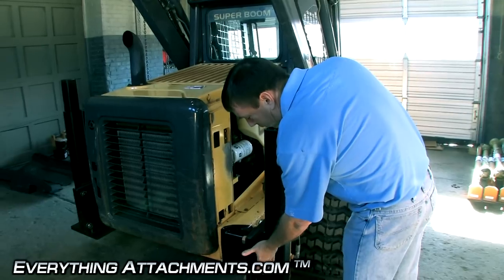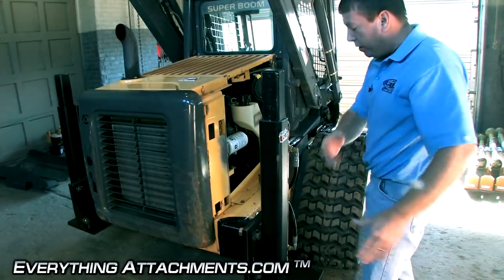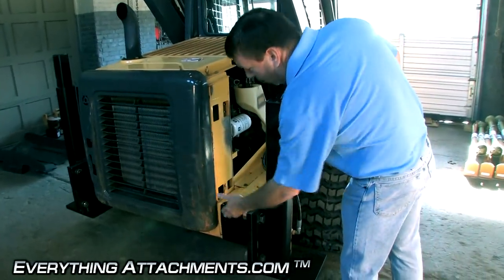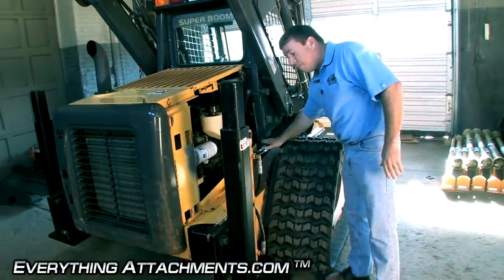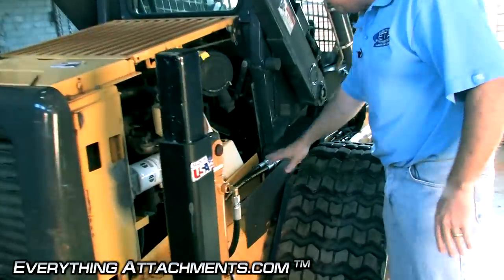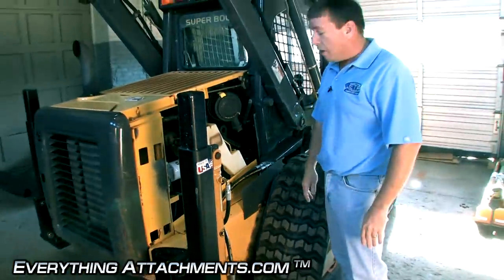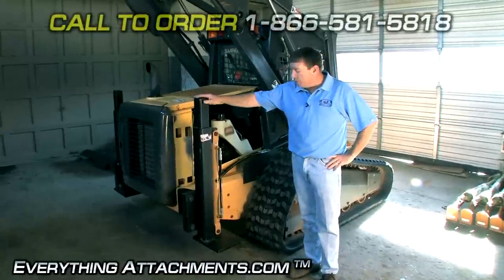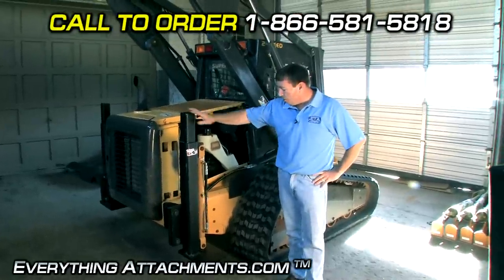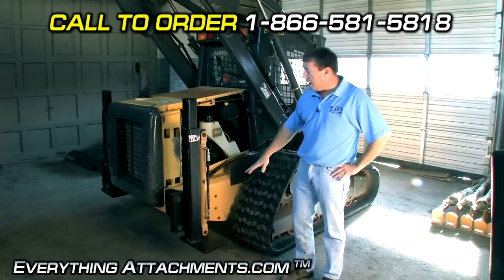At least with this brand you can take these four one inch bolts out and remove the complete stabilizer, only leaving this welded-on bracket to your machine. We've plumbed it here with quick couplers so you can remove them easily. You do also have rear remotes if there was something else you needed hydraulic flow for. We've got our machine running here and we're going to show you just how far they'll pick up the back of the machine and how they're going to work.